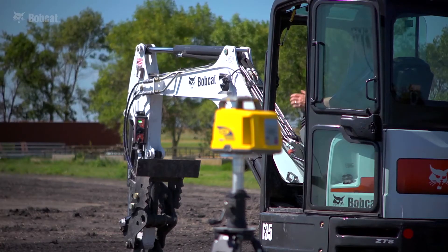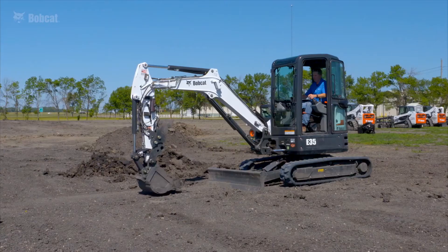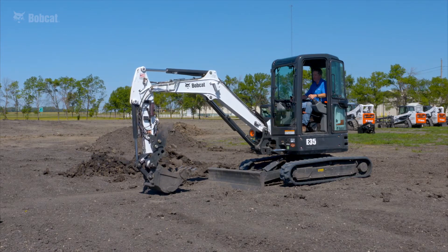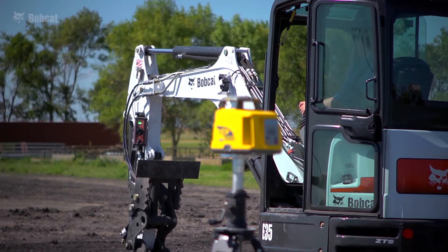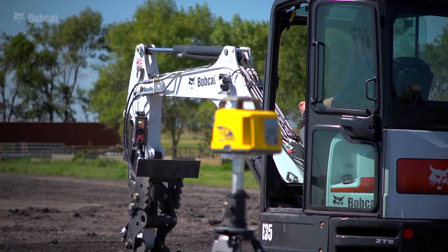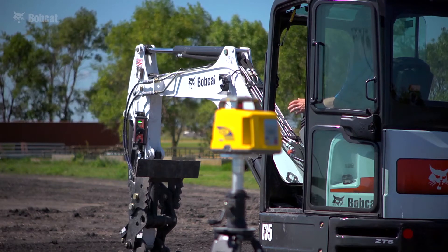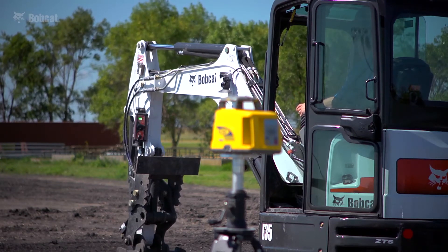We'll be digging in the same fashion. Once I've benched off of my beacon, I'm done with the laser and Depth Check takes over after that. So I'm going to raise up and catch my beacon signal — I have a solid green light. We're using the BLR2. I'm going to reach down and bench. My machine is positioned and planted, blade's down. I will not move the machine after this point.